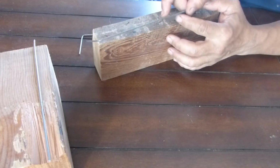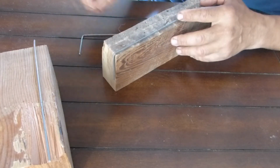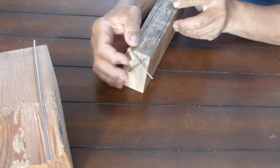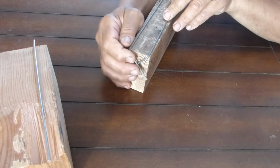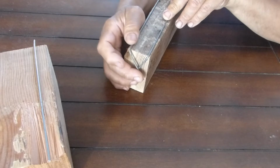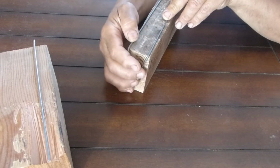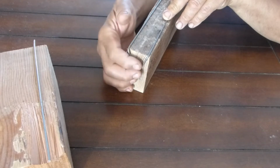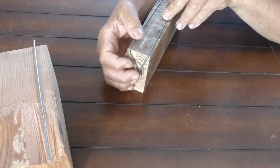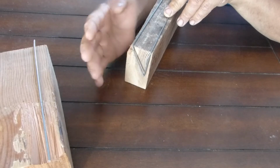These top bars are approximately 13 inches apart, 5/8. I think I misunderstood. 13 inches apart, 5/8. And here's your cross bracing of it. Top bar. Bottom bar is down here somewhere. So this should be the top bar. Top bar, 13 inches apart. And there's our cross bracing again in the wall. So I have it that way also. So there's a cross bracing. That cone that comes out. Down the bottom here is your number 4 rebar.